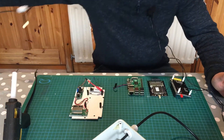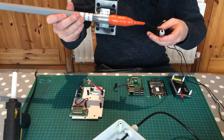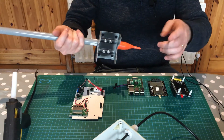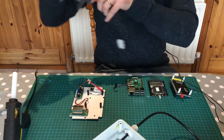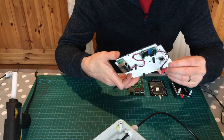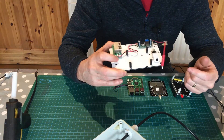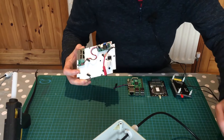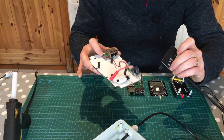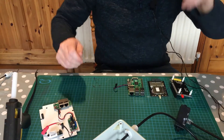I have my antenna which I got from AliExpress — it's a 10 dBi 868 MHz antenna with pigtail, already pre-waterproofed. I have my baseboard which has a bit of power over Ethernet work done on it. I also have a power over Ethernet box — two of them: one to inject the power and one to extract it into my DC-to-DC converter.